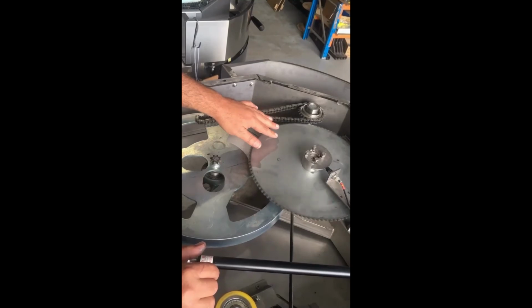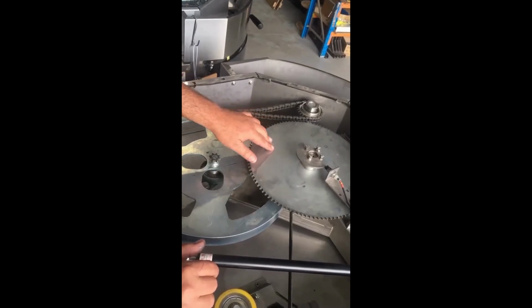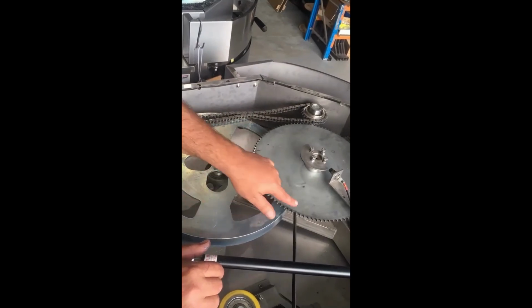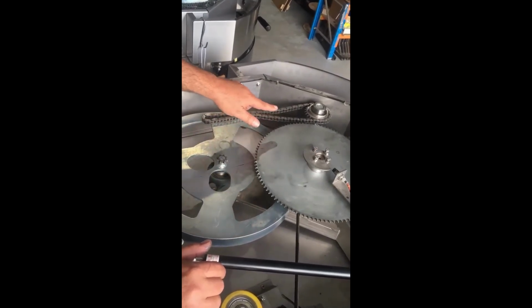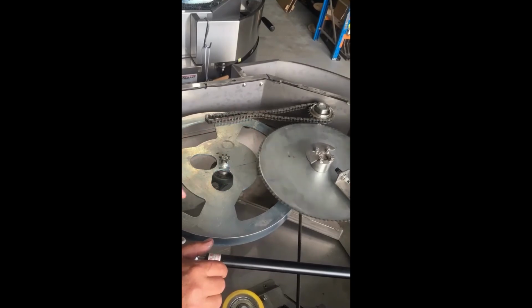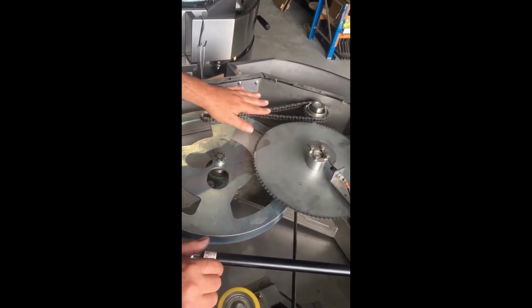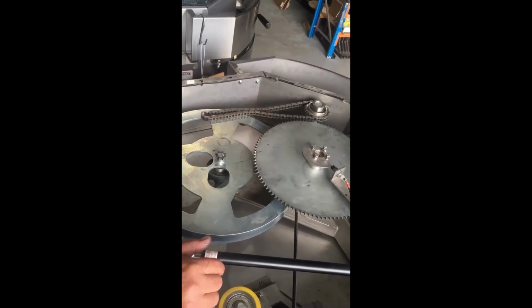Rotate the plate sprocket. This checks the condition of the center shaft bearings. It should turn as free as this and you will feel it hit the drive dog on the rack beneath this plate sprocket. Check the gantry proximity. It should be between 2 to 3 millimeters from the tag that it reads. It should also be centered height-wise to read this.